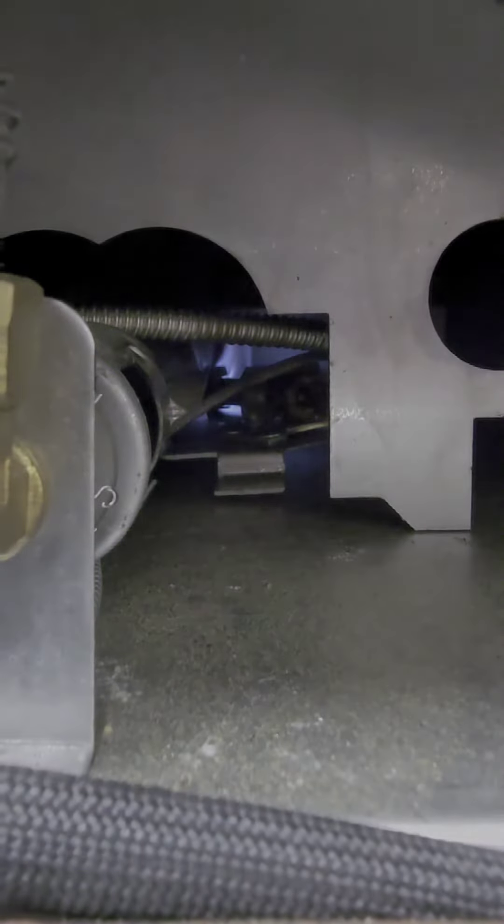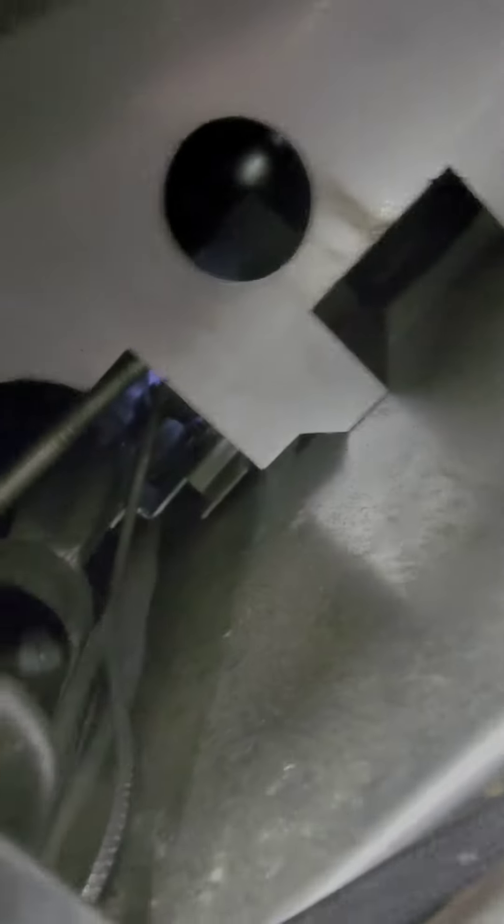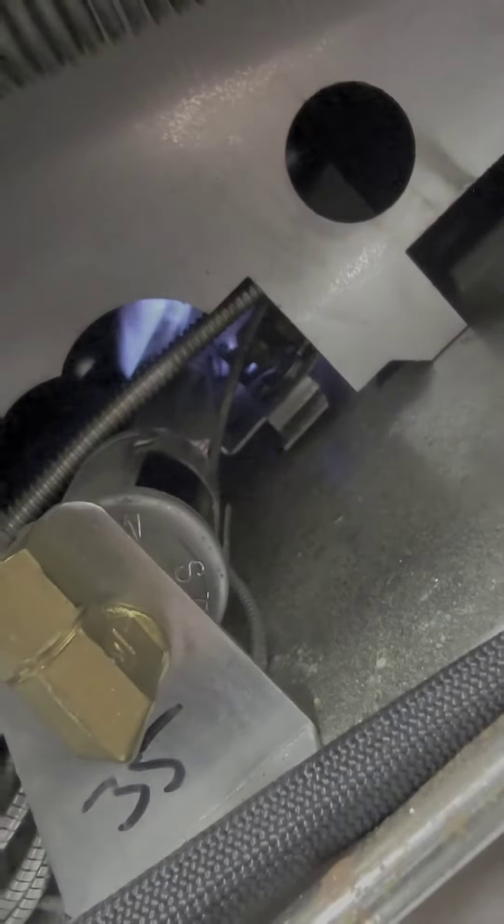You see it? Son of a gun! We're going to hold this down for 30 seconds because if I let my hand off this button right here, that pilot light is going to go out. So after you light the pilot light, you turn this on, then we come up here, we turn it, and there's our whoosh.